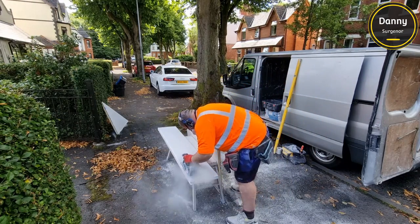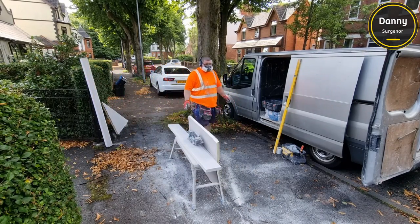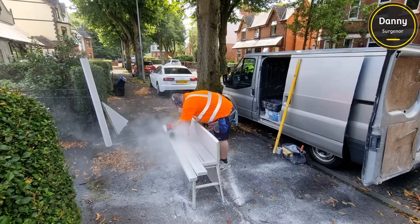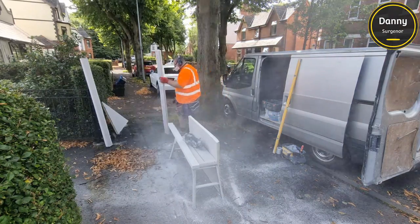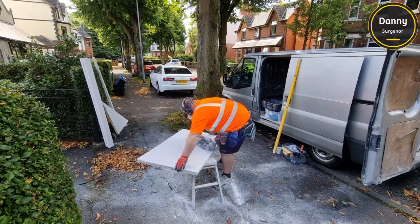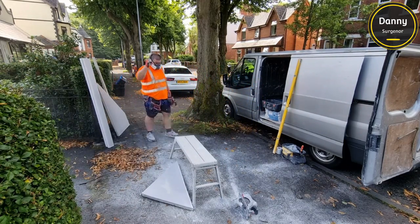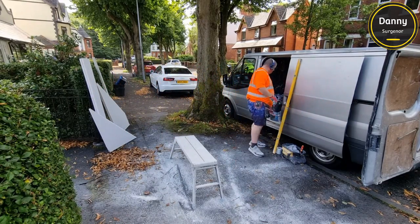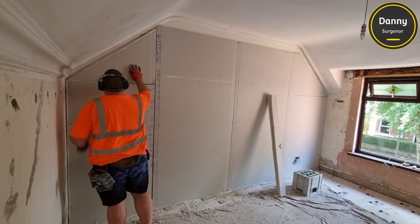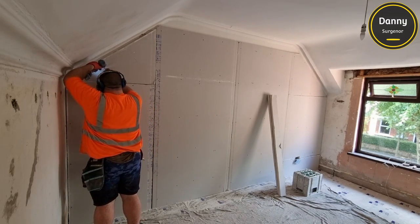If you go over 37.5mm and there are radiators on the wall, the client has to start moving pipes. The sockets - you have to get the wires lengthened - it just adds a whole lot of hassle. But it's a good system to use inside. If you're wanting to offer this system to your clients and you're not a hundred percent sure how to get started, shoot me a PM on Instagram or Facebook and I'll let you know. Obviously if you're not in Belfast I can't help with where to get materials, but I can let you know what materials you need for what system.